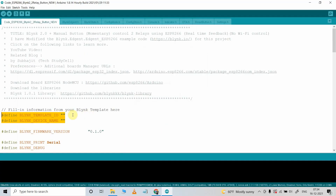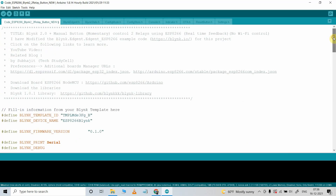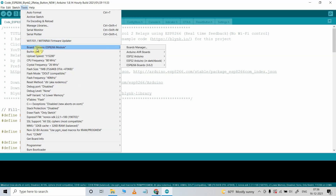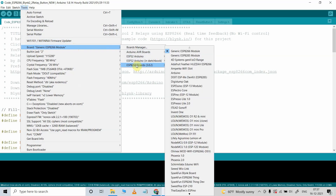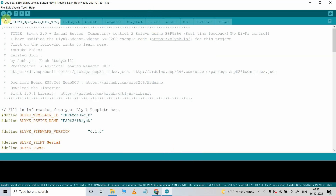Just click here to copy this and paste it into the code. For the ESP-01, I have used these GPIO pins. But if you want to use NodeMCU instead, just uncomment those lines and comment the ESP-01 line — you can use the same code for both. After doing these changes, we can directly upload the code. I have selected generic ESP8266 module for ESP-01; if you use NodeMCU, select NodeMCU 1.0. Then select the proper port and hit the Upload button.